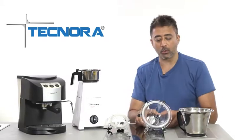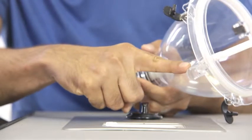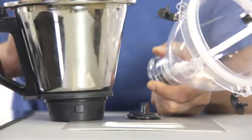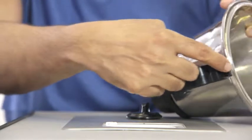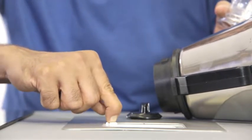There is just one way to put the dome into place. What you see here is a lever that comes out from the dome, and this has got a projection which will fit only into this particular part of the handle on this bridge. This is going to activate a lever inside which will then press the micro switch on this machine.